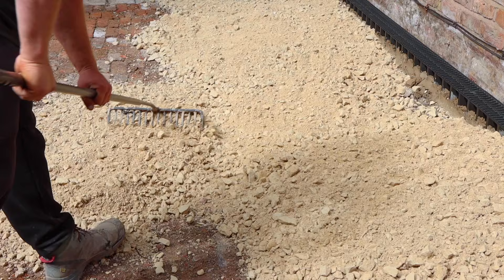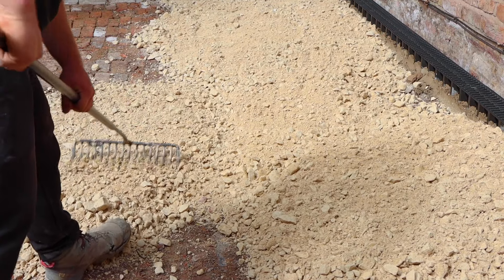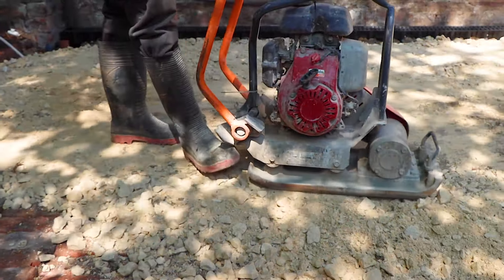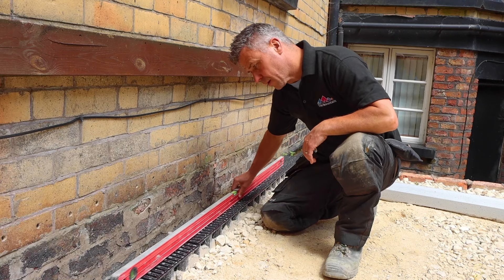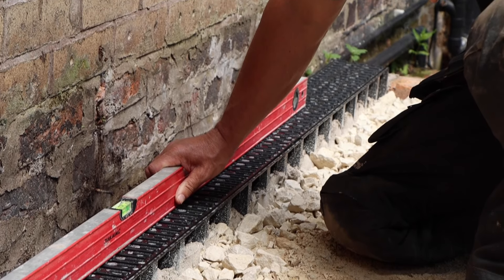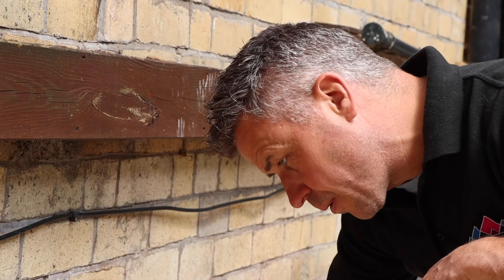The finished slabs want to fall around 20mm across 1.5 metres in length. The MOT roadstone was compacted down using a mechanical wacker plate. This helps bind the crushed stone and firm up the surface. One final check that the drains were level before we started to mix and spread the concrete screed to cover one half of the area for the first method of wet installation.